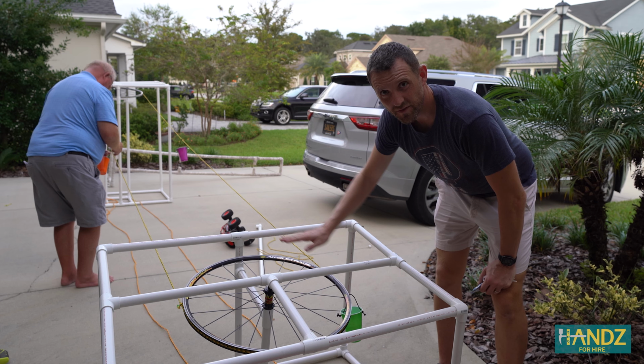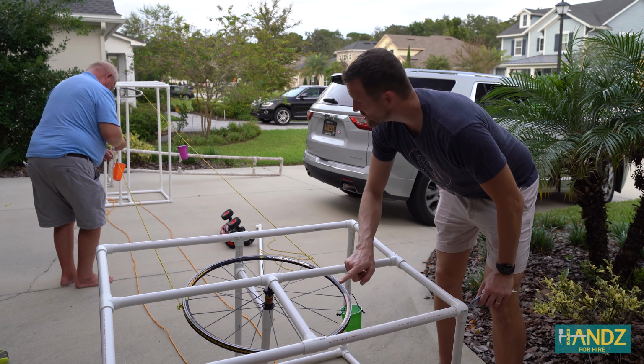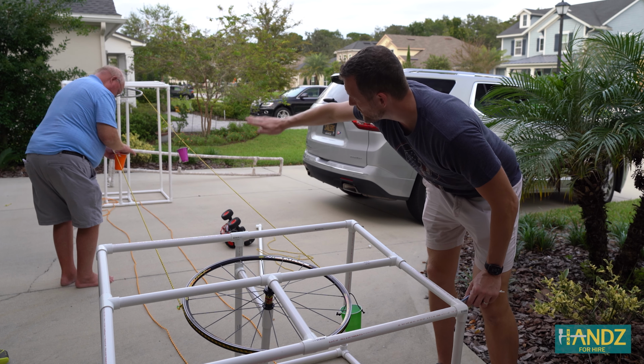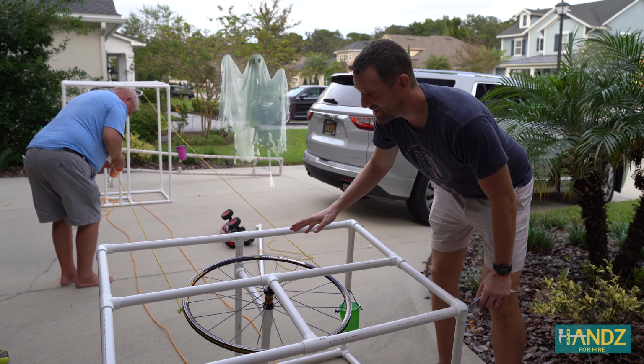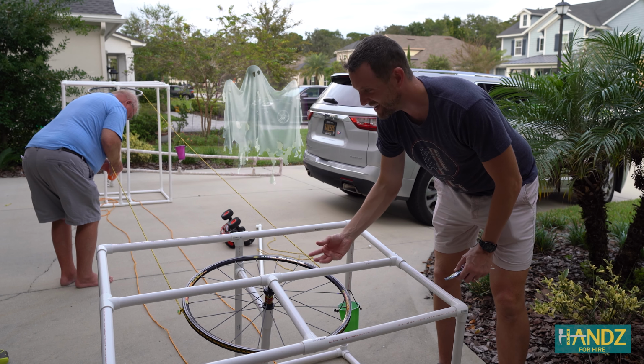Much better. If you're gonna build one yourself, the angle of the lower tire has to directly point to the upper tire. If they don't point directly at each other, then the rope just keeps pulling off every time a knot or anything goes around the wheel.